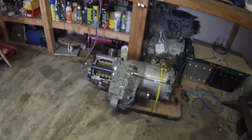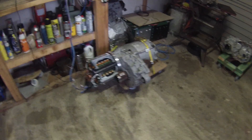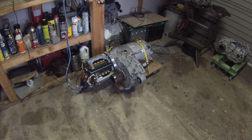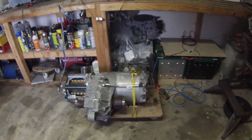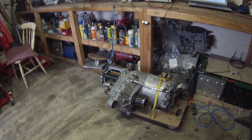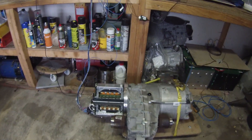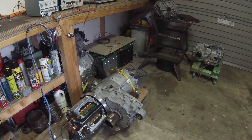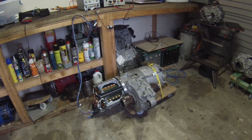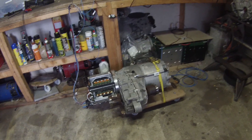We're just doing a few runs here, just shaking her out a little bit as you've probably seen. What we're going to do now is go up a little bit on the RPMs. I'm not going to push too hard because I have no cooling at the minute — once we get coolant on here we'll be able to push some more power through the inverter safely. I'm going to go ahead and run up probably to around 8,000 RPM on the motor, so about 50% of rated speed.